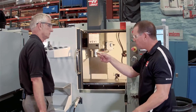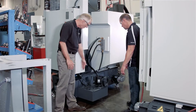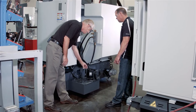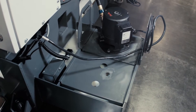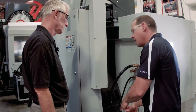So talking about coolant, let's go around the side of the machine — you guys have actually redesigned this whole section as well. What we did was bring the back of the tank out, drop the bottom a little, bring the coolant level up, and that's how we doubled the coolant volume. That allowed us room to put the standard tank here with a TSC side-by-side, or pop in our standard high-flow tank right off our VMCs. This looks a lot more user-friendly — where you used to have interferences, now when you add TSC you drop it straight down with no sheet metal in your way, nothing to worry about. We also changed how the coolant flows and how we port the coolant, and that allows us to get rid of the filter.